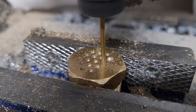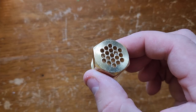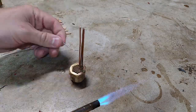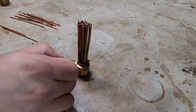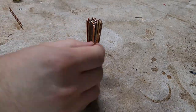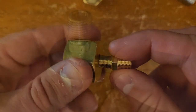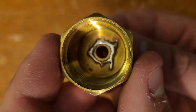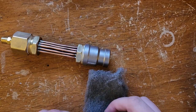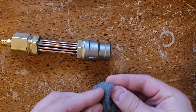For starters, I designed the new heat exchangers to be an array of small diameter copper tubes, which allowed me to make them much longer than the previous ones, which had just been drilled out of a block of aluminum. I drilled three-quarter inch NPT plugs and soldered in copper tubes with a two millimeter inner diameter. These would be connected to a three-quarter inch NPT cap tapped for a one-eighth NPT adapter and soldered to seal up the threads. This adapter would connect to the piston cylinder, and on the other end, a three-quarter inch to one-half inch stainless coupler would serve as a housing for the regenerator mesh and connect to the pulse tube.